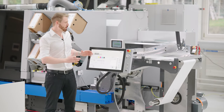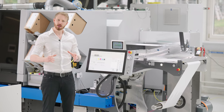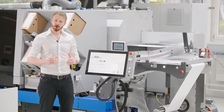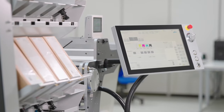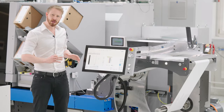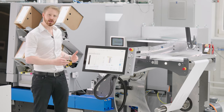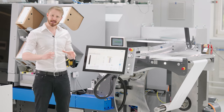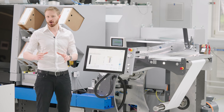At the end of our equipment we also have our rewinding unit, which is optionally equippable with a slitter unit. The whole machine is operable from our unified HMI. On this HMI you also have the capability to access our vision system, which helps the operator to automatically adjust the register and always have a live view to control the production. This HMI is exactly the same as on our Gallus Label Master, Label Fire, and also on the RCS.